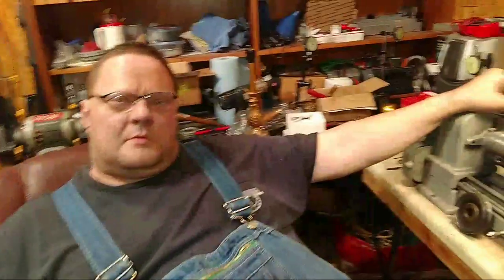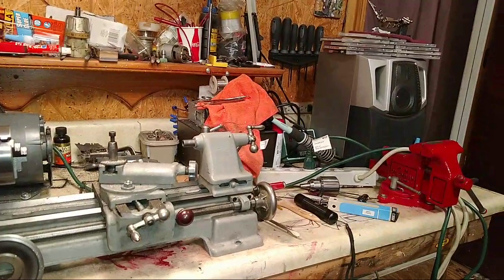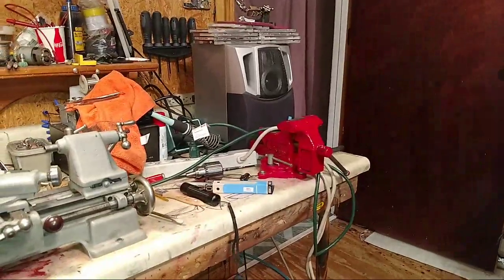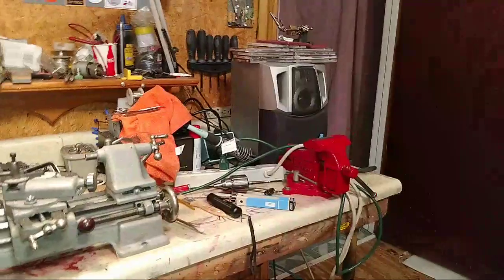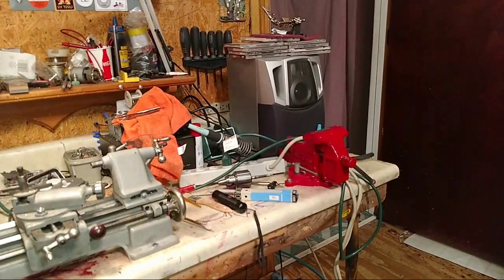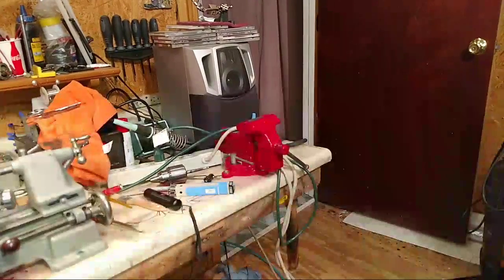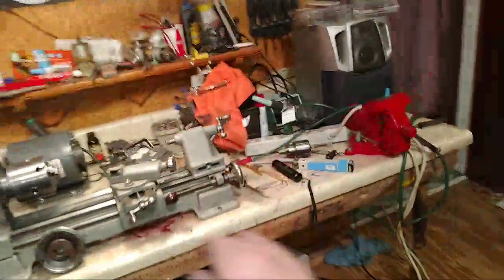What? Buck said, it's how you say my last name. Okay, let me turn it around here for us. Calibro. Okay. Well, what did Ryan say? One search says that the Craftsman 109 uses a short Morse taper zero, the wider end reduced, so if that's right, it means a normal MT0 will not work. Ah, okay, I got you. So he's talking about this.